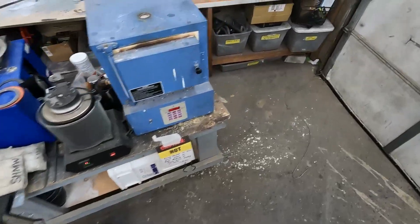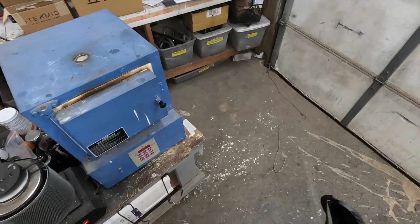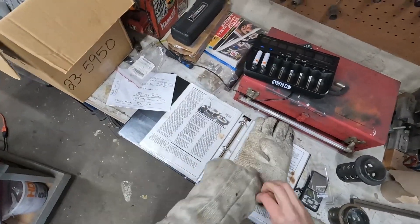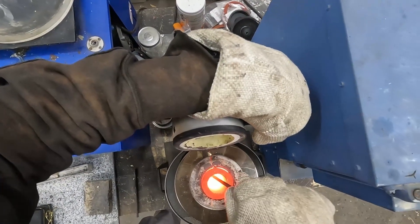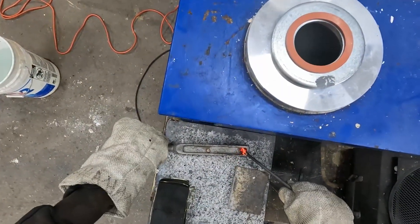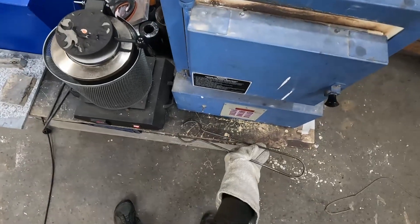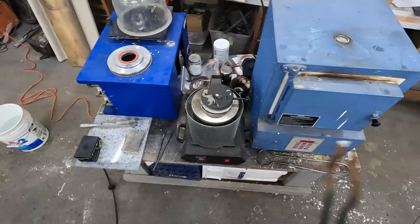Now we're just waiting for this to come up to temperature. It's important when looking at molten metal to use dark goggles because there's infrared energy that could damage your corneas. Putting on gloves. We've got carbon stirring rods to poke the metal and look inside — you can see how fully liquid it is. The carbon rod attracts any impurities, which kind of pop off. These tongs are for picking up the crucible, and these tongs are for picking the cylinder out of the oven.